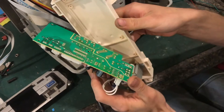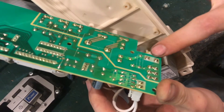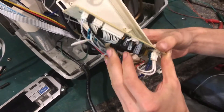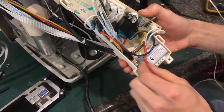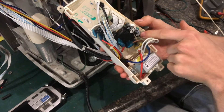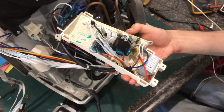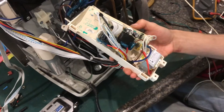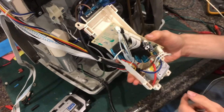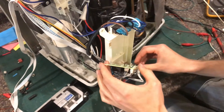This connection here, and then all the way down to that white box, is the 120-volt hot region into the primary of the transformer. Everything from the white wires to the rest of the board is all 12 or 15 volt — safe to touch, safe to poke around — though if you short something it would still spark a lot but it wouldn't be able to harm you.